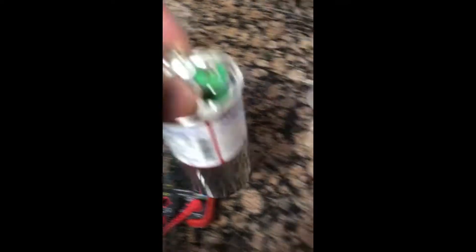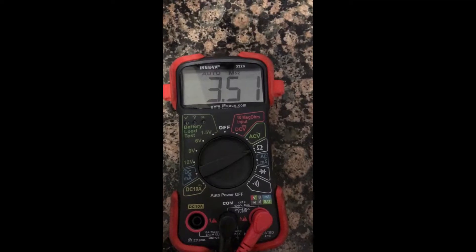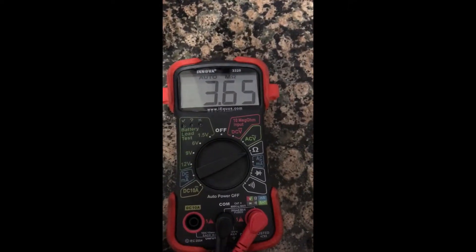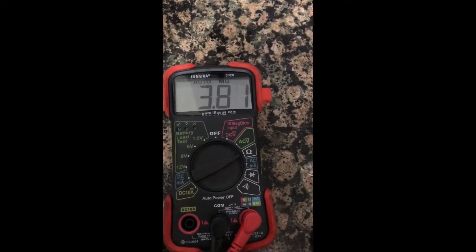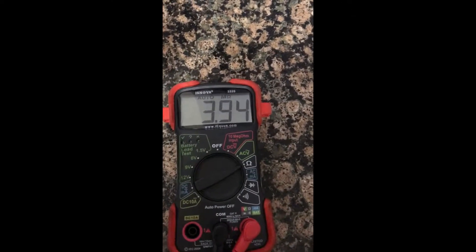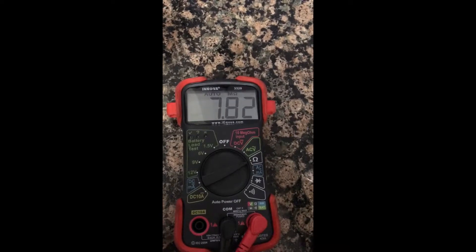So I got a new one. My model number rubbed off on this one, but you can get it matched up — you can take the old one and they can match it up. So this is what my new one is. And if I go across the herms and the common — see my ohms? 3.5, it's going up. That lets me know that this capacitor is good. And my old one, it didn't even change, nothing moved, no matter what I went across, nothing changed. I go across the other side, it changed — 7, 8.